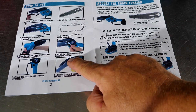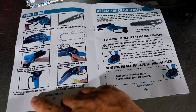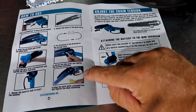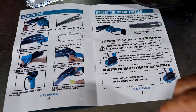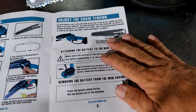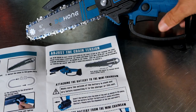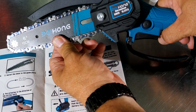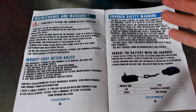Install the side cover and tighten the screws clockwise — I'm assuming they mean the nut and stud on the chainsaw. Then unlock the security lock to start the machine. It also looks like you're supposed to be oiling the chain, so I'm assuming you should oil it manually before use — we'll be sure to do that. It says a new chain is easy to stretch and you need to make sure it's tightened. Pull down the chain to reveal three chain guide teeth; it shouldn't be loose enough where you're seeing more than three. And that's about it for the manual other than maintenance and warranty.